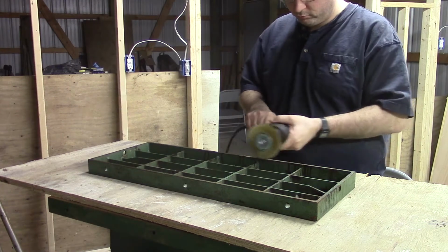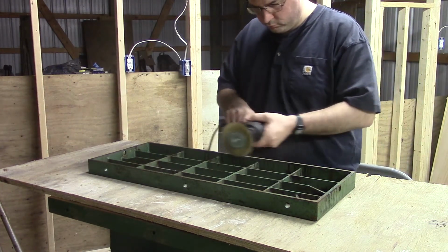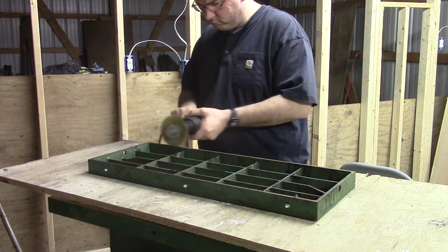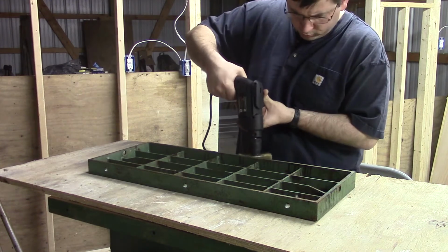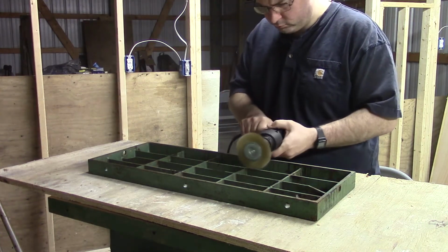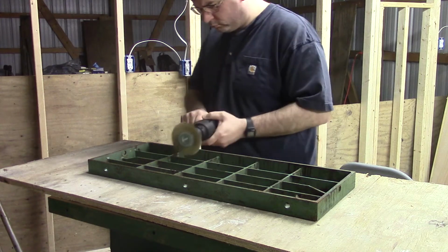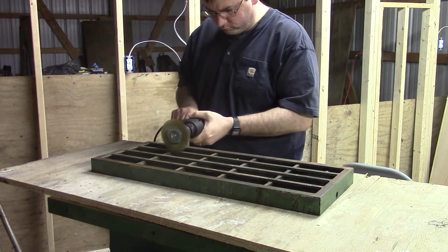Now the wings, the table, and all the undercarriage are all made out of cast iron. So all the rust removal I'm going to do is going to be with brass brushes. If I use anything harder than brass, it could scratch up this cast iron, which is not a big deal for the bottom of the table, but I want to be able to get myself down to a mirror finish on the top of the table. In some of these spots you can see just clouds of rust just flying up off here. And even though I edited this down to just a few minutes, the overall process took about half hour to 45 minutes per wing.